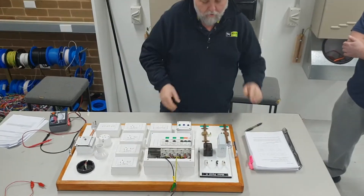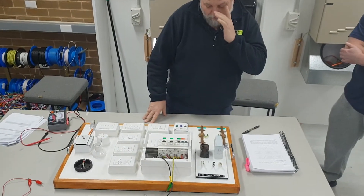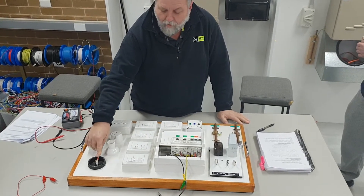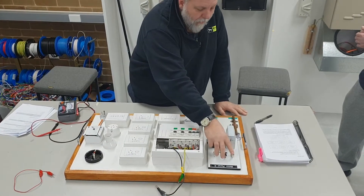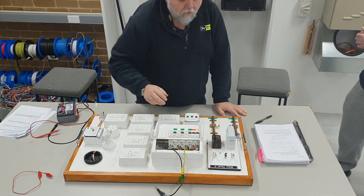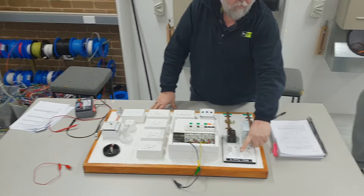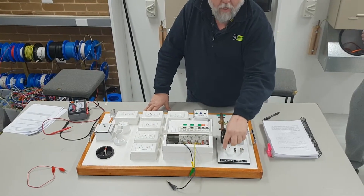You're probably doing this when it's first being hooked up. You'll either have your pit underground - we've got our underground pit here and our meter box. The four mil coming out of here is the minimum size we need to go to the meter. You've got to remember a kilowatt hour meter is measuring the current going through into the installation.